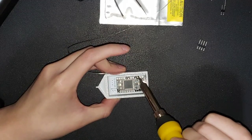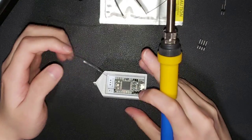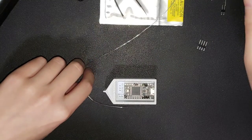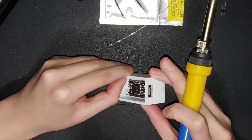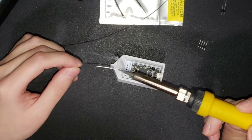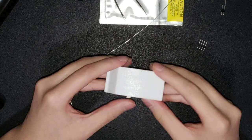It's all about trying it out for yourself, I think. That's the most important thing, to find a good temperature that you like to work with. I think people generally go a little bit higher, maybe like 350-ish, just so it's very quick. If you make the right contact, the solder will go right in and you could release it within like 3 seconds. But I try to skirt on the lowest possible setting I can while still being generally effective. So right now for my machine, I'm sitting at like 330 to 325.